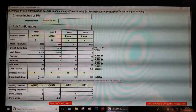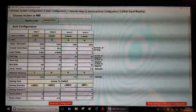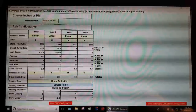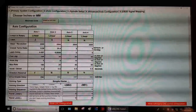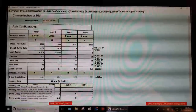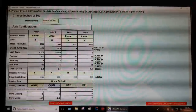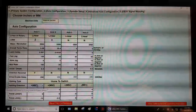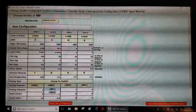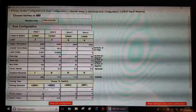Direction reversal: sometimes when you build your machine you need to reverse the mechanical direction of an axis. That's the case on my machine — I have to reverse Z, but X is fine. Use this setting to reverse the direction of an axis. Don't invert the direction signal the old Mach 3 way; in Centroid world, use this direction reversal setting instead. Drive enable delay is just the number of milliseconds to delay enabling the drive at power-up — use the defaults.